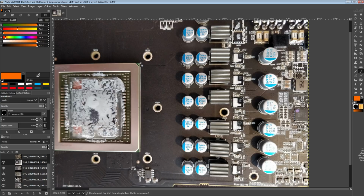Well, these could also end up with higher ESR, but you can get like a 5 milliohm ESR through-hole capacitor just fine. And admittedly, you can get like 3 milliohm ESR 3-terminal SMD polymers, but those aren't very popular because those are extremely expensive. But the thing is, you can kind of work around the higher ESR and the higher ESL by just putting more capacitors in parallel, but Sapphire hasn't even done that.